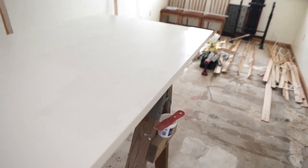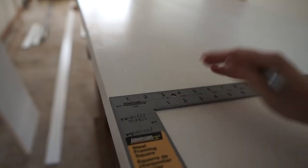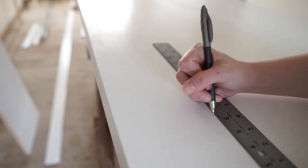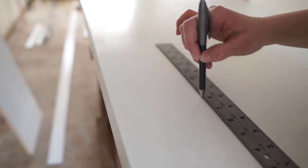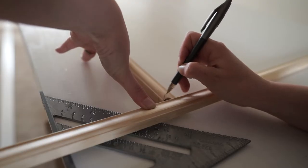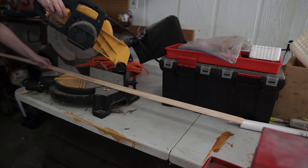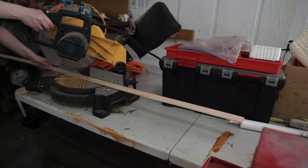In total for this project I ended up doing three coats of paint. When it came time to lay the trim on the door, I went five inches in from the left and five inches in from the right, then six inches from the bottom and six inches from the top. I used a carpenter square to mark all the way around, so by the time I was done I had a drawn-out rectangle on my door.